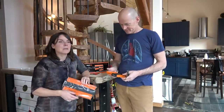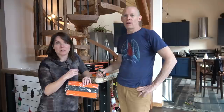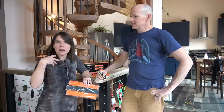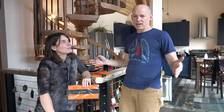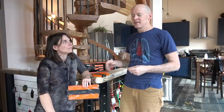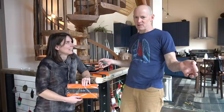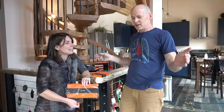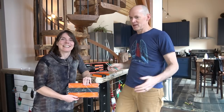So this is where you use the contour gauge to fit the top railing on the stairs. Right. A very tricky piece because you're attaching it between two big round posts. The tricky part was it was sitting between the center post of the staircase and the railing, so trying to find the length is almost impossible. You can get close measuring, but you can't really. So I got it close, then wedged it in and worked it down to the right length.